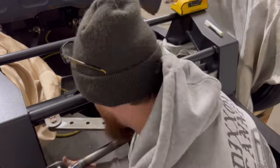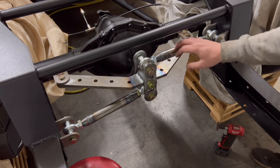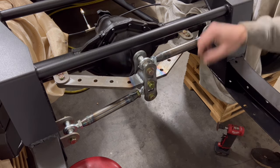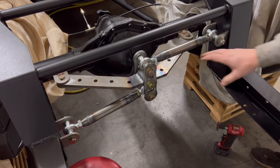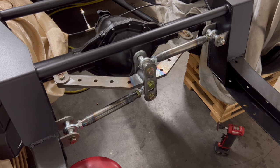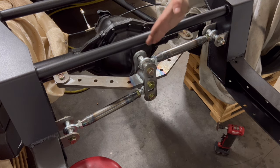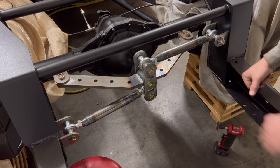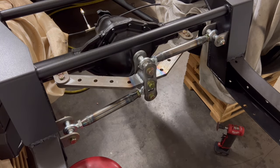I don't have anything welded in yet — I got these brackets very close to where I want them and twisted them out to add pressure on both sides, giving just enough pressure to put a level on it and move them to where I need. Inside to outside they're level, using the bar as a reference. The bar is right on where it needs to be on both sides and it's looking really good.